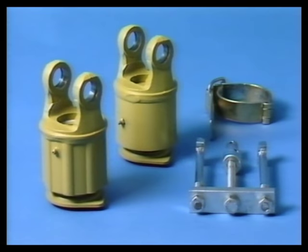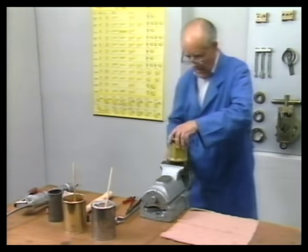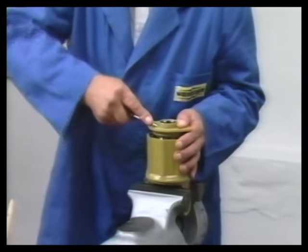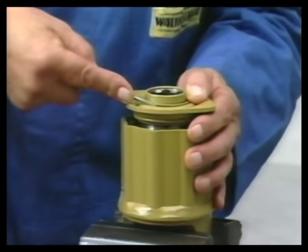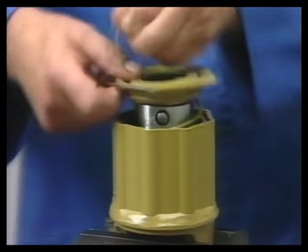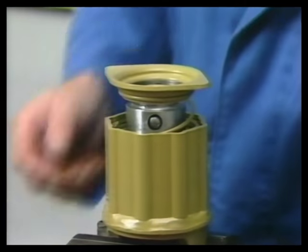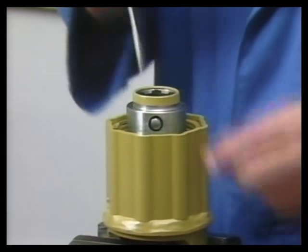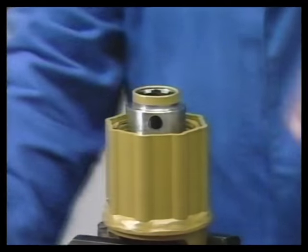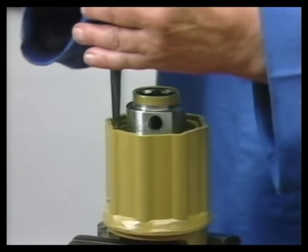To dismantle and assemble the star ratchet, it is necessary to have the dismantling and assembly tools SW24 and SW04. First, remove the pull lock. Release retaining ring. Lift off spacer ring and locking collar with compression spring and remove locking balls. Then remove circlip and sealing ring.